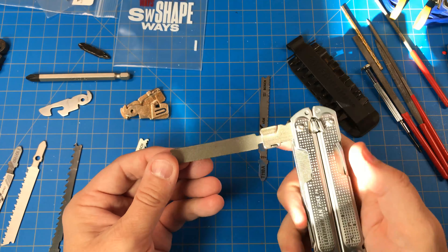So this is the second prototype I've designed, and what I did was replace half of it with nylon. You can see there's a little bit of a wear mark there, and that's deliberate — this is a spring arm. So when this closes, it will dovetail in like that, dovetailing on the top and right here. The spring arm works inside to hold different thicknesses of bits, and once closed they lock together. I want to clean this up a little bit and make it tighter, and right now when it closes it's kind of pushing the piece up, so I just need to tweak that.